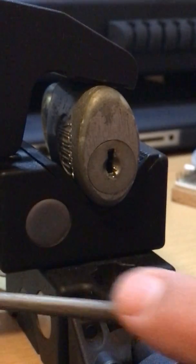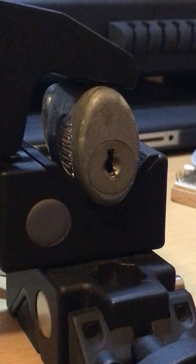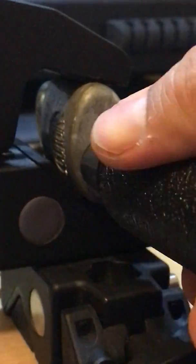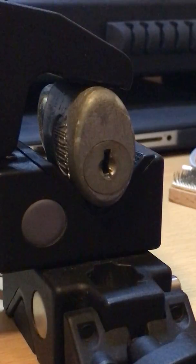I'm holding the file about halfway down and do about four passes to change the depth — one, two, three, four — so four passes of about that length to change the depth. Sometimes a little less. I don't really have a working key for this, so this is an actual making of a key. That'll be what it looks like when you get pretty proficient at the motion — I've done it thousands of times. I had pretty good marks up on four and a good mark on three as well.